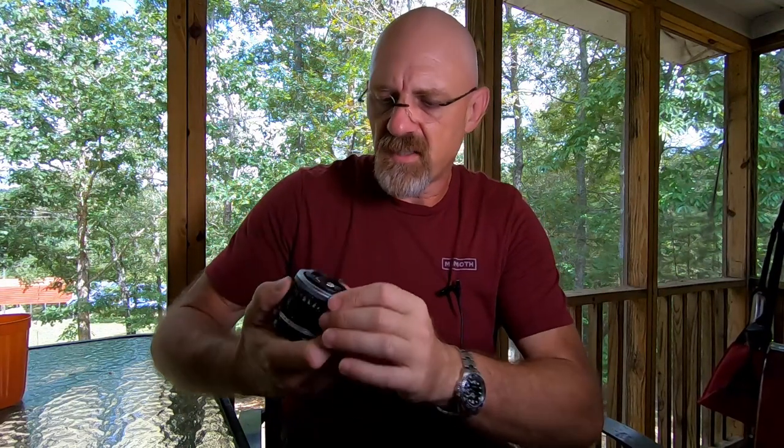What I have is the Canon 58mm f/1.2 breech lock lens. The breech lock lenses are unique in that they don't have a standard bayonet. A standard bayonet lens has a brass — chrome-plated brass 90% of the time, sometimes plastic — a mount that has three lugs usually on it that interfaces with the mount on the camera, and then it turns and usually there'll be a latch detent somewhere on the mechanism. There's a little slot right here, a pin drops into that slot and locks it in place, keeping the lens from rotating.